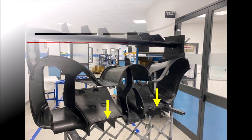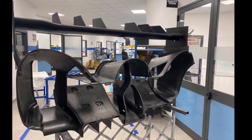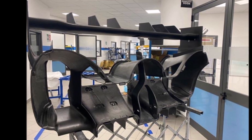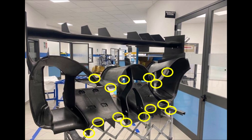You would usually split an underbody of a race car before the diffuser section and avoid having split lines within suction areas. Here it looks like Glickenhaus split the rear part within the diffuser. The problem with that is that the alignment of such a large assembly is very important — if it's not exactly right you can create gaps or steps which could disrupt the diffuser airflow and cause separations. To make sure the alignment is as good as possible, they added a number of alignment joggles around the rear.